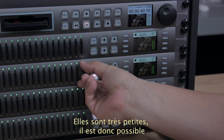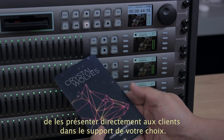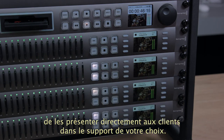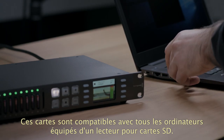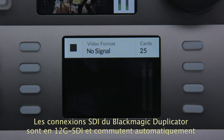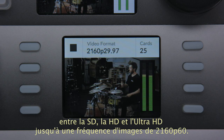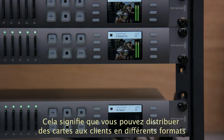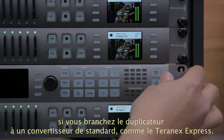The SD cards are very thin, so each duplicator can fit more of them across the front panel, and they present well to customers in a printed wallet. SD cards are very compatible as virtually all modern computers have SD card slots built in. The SDI connections on the Blackmagic Duplicator are the latest 12G SDI that auto-switch all SD, HD, and Ultra HD formats up to the high frame rate 2160p60. This means you could even supply cards to customers in different formats if you connect some duplicators via a standards converter such as Teranex Express.